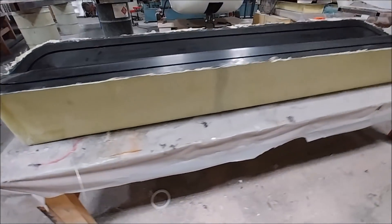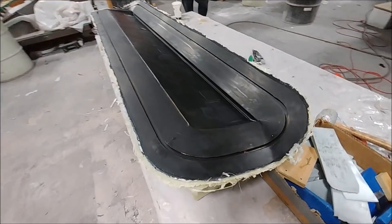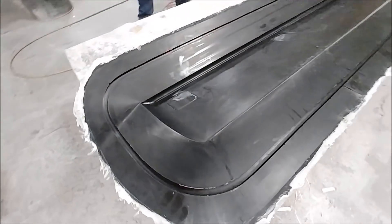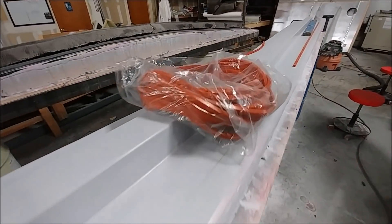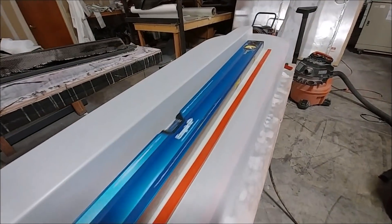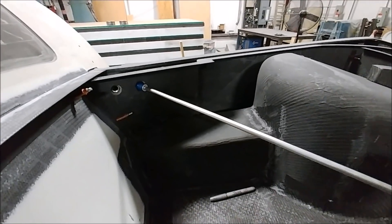This was the other mold that got laid up for the second side of the lower elevator skin — because we had a left one and a right one. That one got the bracing bonded in with the glass as you saw earlier when it was prepped, and it just needs to be trimmed around the outside edge. And there's the other one, so there are two — not just pretending. Here's the plug for the main spar for the foreplane, all waxed now. Devon got started on gluing down the rubber profile, and once that's done it'll be ready to pull the mold off.